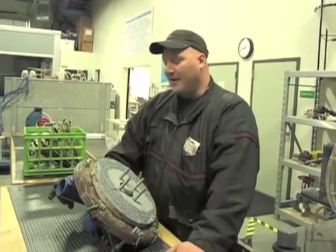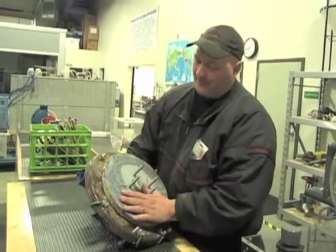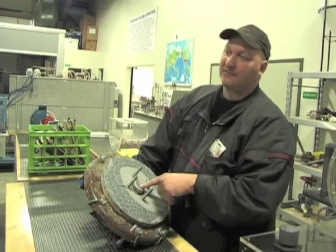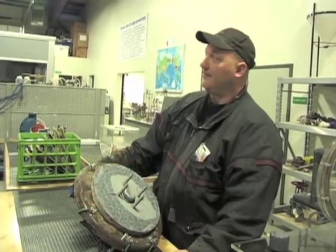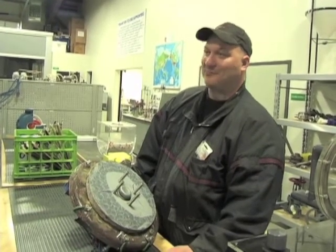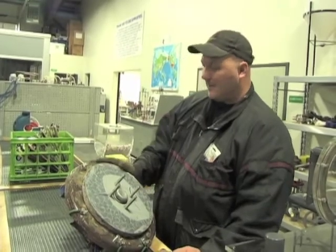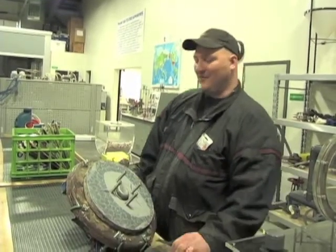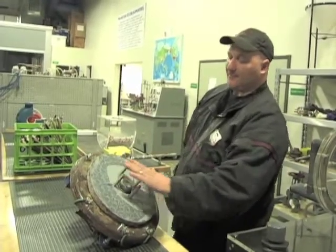Despite its ugly look, it works quite well. It's very sturdy with not a lot of moving parts except for this hub. In the hub we use arctic grease, so it's good to 55 below zero — it'll spin. In a moment I'll show you an example of one that's been spinning for two years, winters and summers. This is basically a wind generator. You can see the mounts here for the blades.